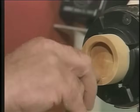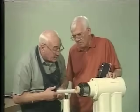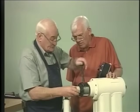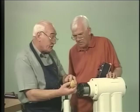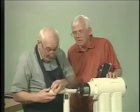But you can see the purpose of the groove now, Charles. Yes. It just gives me a chance to pull the chaser off before we wreck it. Right. So now we can take that out, and we can now start with the male thread to match the two together. You'll notice on this one, there's a plain part ahead of the thread. Yes. That's a spigot that we're going to work to, and I'll show you the purpose of that as we go.